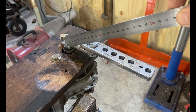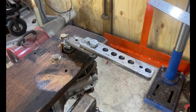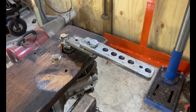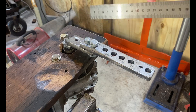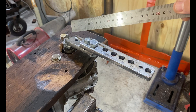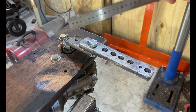Don't worry about the staggered business on my bracket here — this is fairly convoluted and will not be necessary for you. You'll just have a normal piece. This is staggered in three stages because originally when I was building this bracket it was a test, and it took me a while to work out my finishing length on my lever bracket for the correct geometry in the rear traction loss motor. You will just have a 110 millimeter piece that goes onto your motor shaft, and you'll only stagger your 160 millimeter piece on top of that piece.